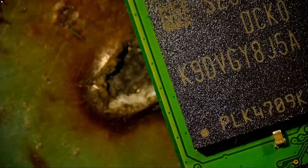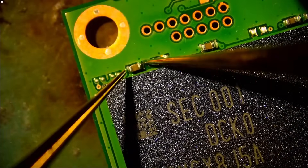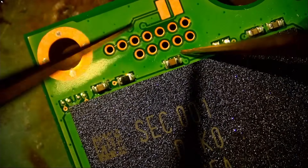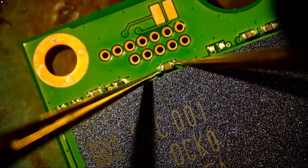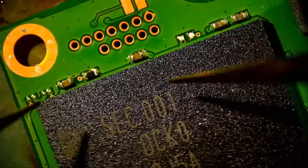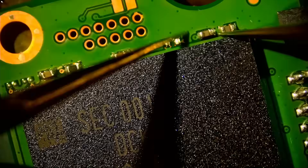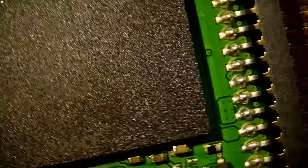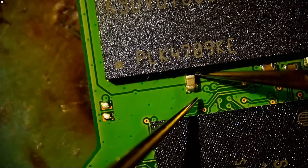What we are going to do is meter in diode mode, and we are going to inspect capacitors from side to side. We did not get a continuous beep for a short. The reading I am getting now is 0.5 voltage drop, which is good. We do not want to hear a long beep. You can also measure in resistance mode or continuity mode and look out for a beep or a 0 ohm reading.